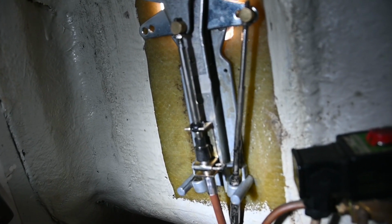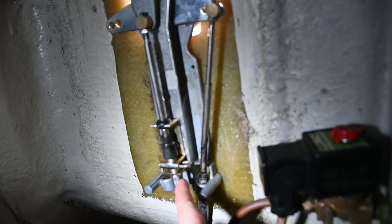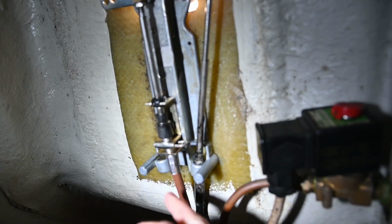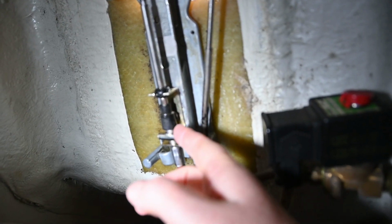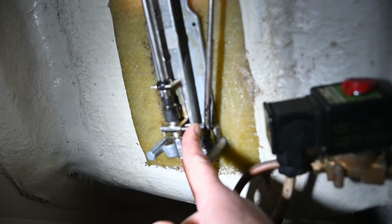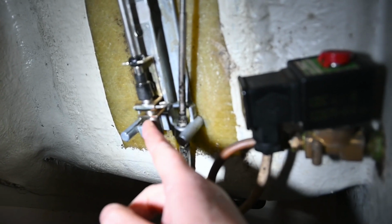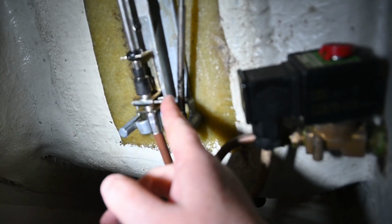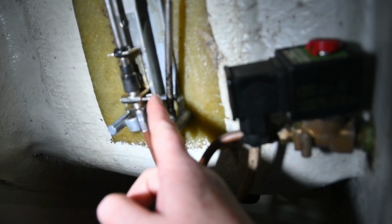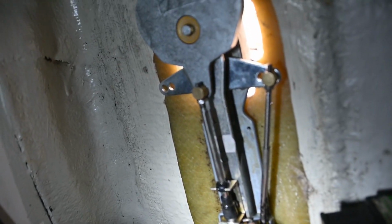In the end, the problem that we had with the cable was this cable. This is our throttle cable here. It was where this pin goes in. There is a slot in a throttle cable, and that slot has to exactly fit inside that U shape, and that pin has to go on. And when I fitted it, I hadn't quite pushed it all the way in, and I think the slot was sitting in the groove of the bend of the metal. So just that few millimetres difference, when we reset it and pushed it into position, so you can see it's reset.